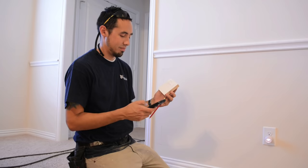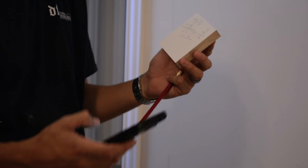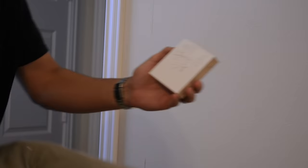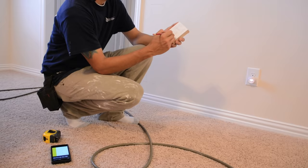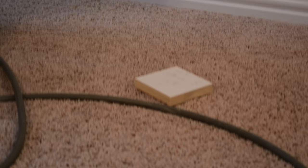I went to a public school, so bear with me on the mental math. 85 and three quarters minus 16 is 69 and three quarters. Now that I have 69 and three quarters, I'll divide that by five because that's how many boxes I want, and that comes out to 14 inches wide per box, which is fine. I'll just measure this out to verify it's going to fit.